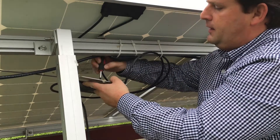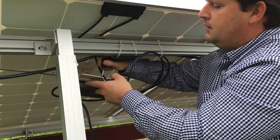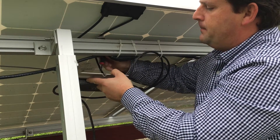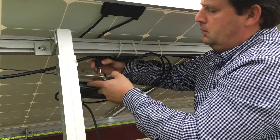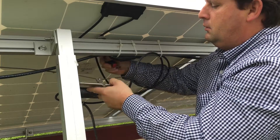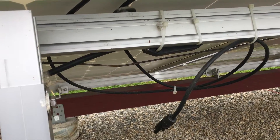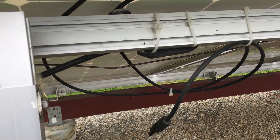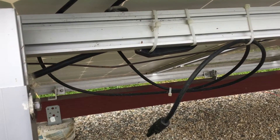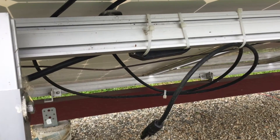This one has the ground connector on it — it's a first-generation M215, so I have to release the ground cable. I went ahead and took the M215 off and I'm going to put my M250 on in this location. Switching the microinverters — halfway done. I was able to keep the trunk attached through the cable ties.